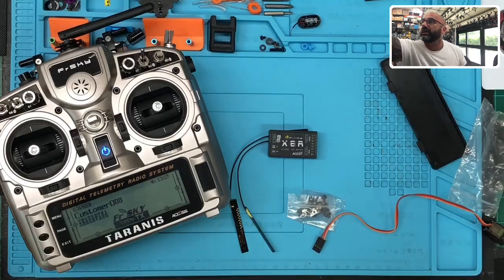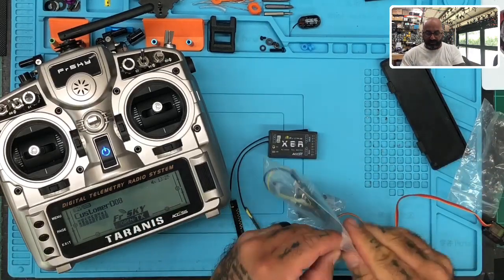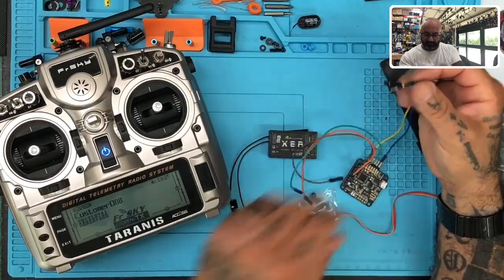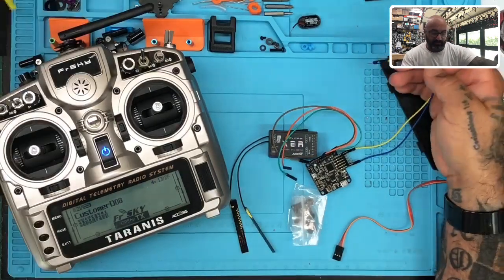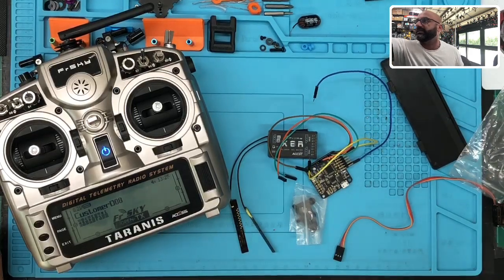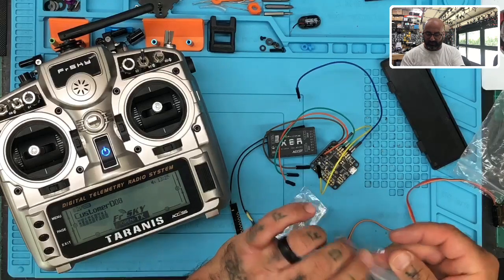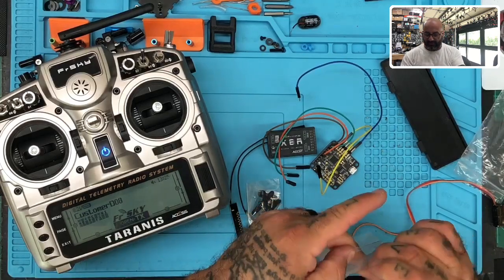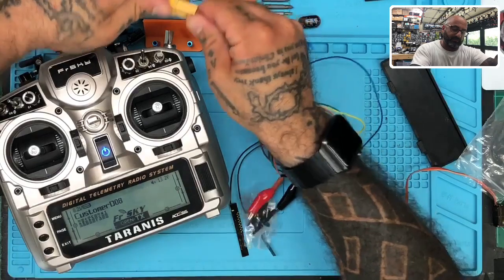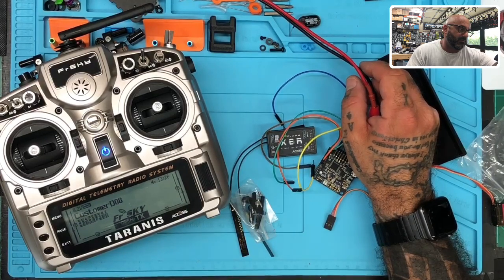I do need to give a five-volt power source to this. I'm using the same Naze32 board I used to test S.Bus in Betaflight — I'm going to use that as my power source. Yellow will be positive and blue will be ground. I'll give it five volts from the AC-to-DC converter. The Naze32 doesn't have a regulator to step 12V down, so I'll just adjust my voltage output to five volts directly.